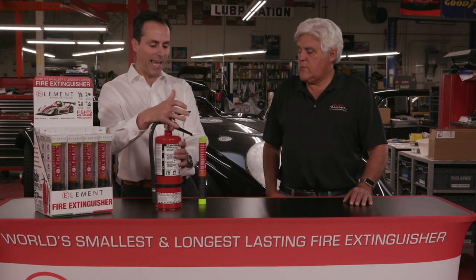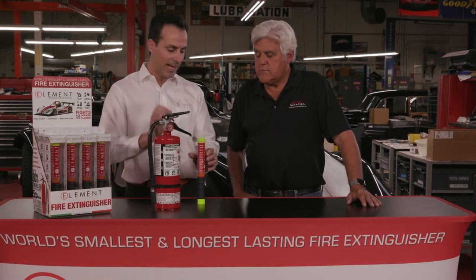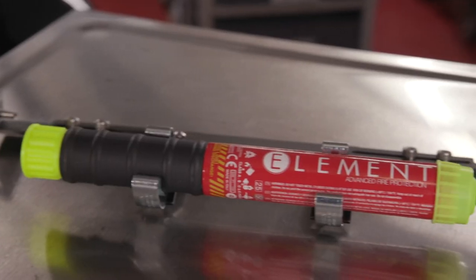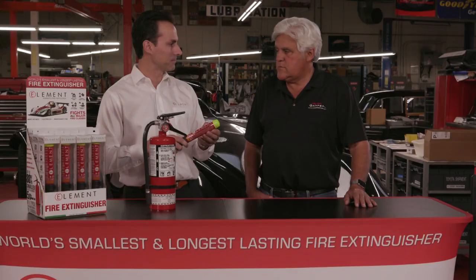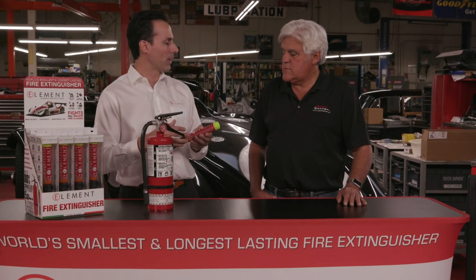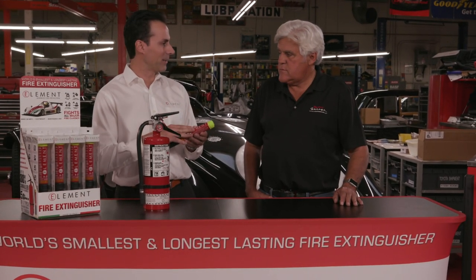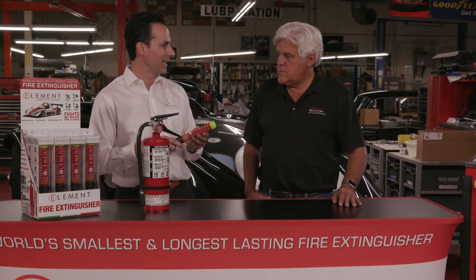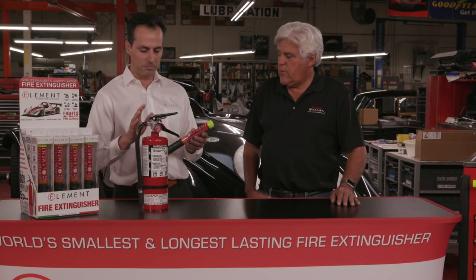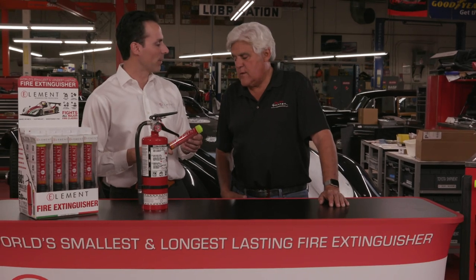But nine to eleven seconds, and the other thing is that you need to service and maintain them as well. Element is something completely different. It's actually a solid chemical propellant, and inside it has a chemical that, once discharged, actually fights fires on the molecular level. So it makes no mess of any kind, it doesn't rob oxygen, and the coolest thing is it never expires, never requires any service. And the discharge time is actually about fifty seconds compared to twelve seconds for a traditional extinguisher — so it's almost a minute versus twelve seconds. You have a lot more firefighting time.